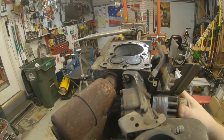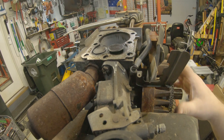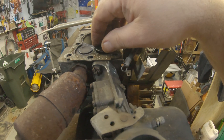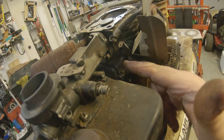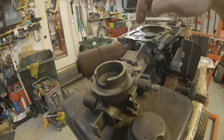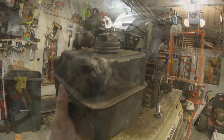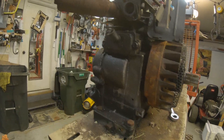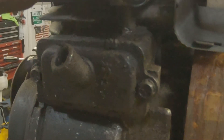I was able to push that valve back down a little bit — kind of pecked on it with a rubber hammer. I'm still going to pull the back plate. I think I could put this thing back together right now and probably get it running, but I'm going to go ahead and pull this plate off the back. I've got to pull this tank off to get to that, go ahead and take these valves out, and just look at them a little closer to make sure there's nothing stuck down in there — a piece of carbon or something. Right behind there, we'll take that little cover off, and that's how we get to those valves.